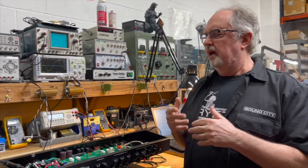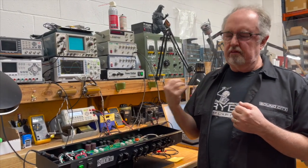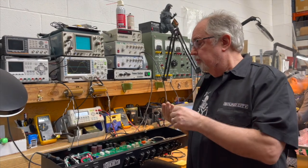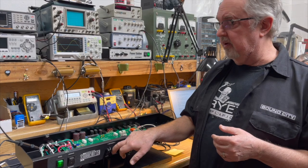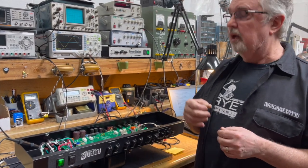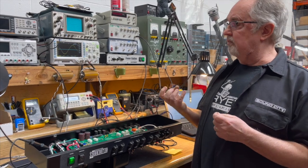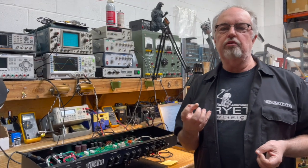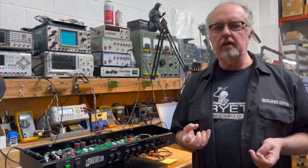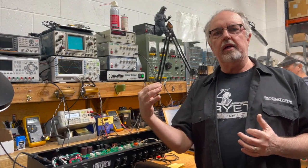Right. And there's other things going on, and we'll get into that shortly. But the lack of credible attenuators at the time would be a reason not to do that. The other reason is, if you variac the thing down so that you're getting saturation, you're not hitting the output transformer hard enough to get it to saturate. So now the output transformer is cleaner. It's got a better bottom end and a better top end.